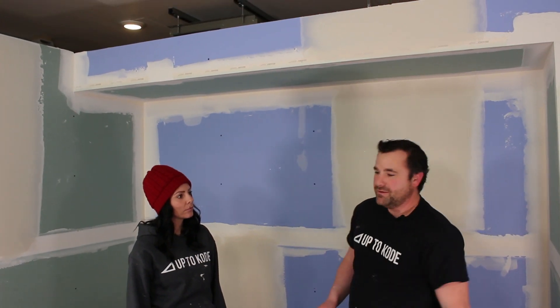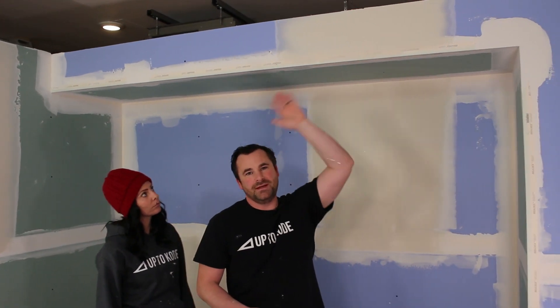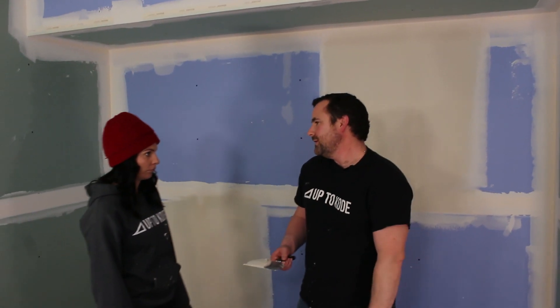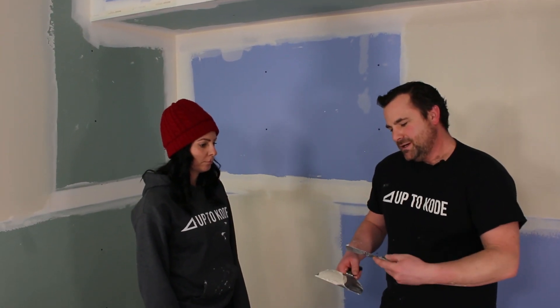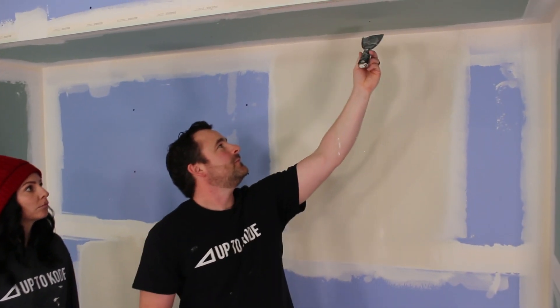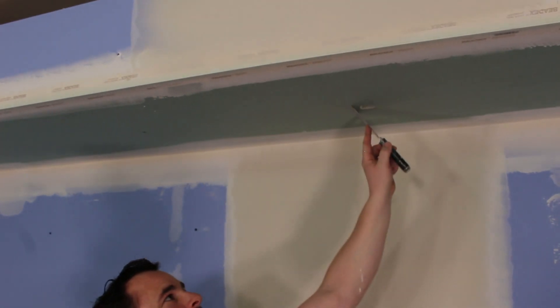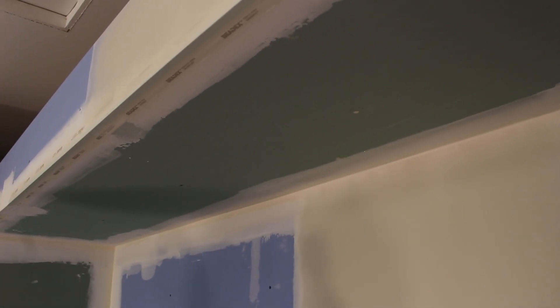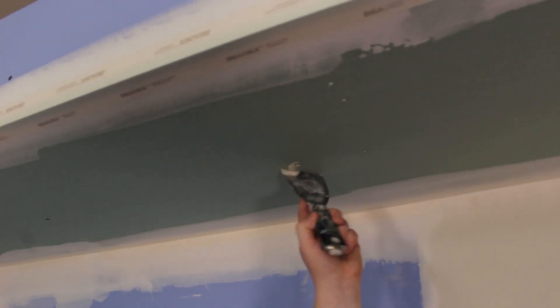Just to note, I didn't forget the butt joint above us. That's important to the steps and procedures — it'll be nice and dry when we go to coat the beads, so we won't ride over top of that butt joint and create a wave. Let's do the first coat on these screws. You just need a little tiny bit of mud on the corner — just a little bit, because you're going to have to do this three times. I like to just put it in one way and wipe it another — put it one way, wipe it the other. If you keep them small when you do three coats, it doesn't end up a big blob with a lot of sanding to do later.